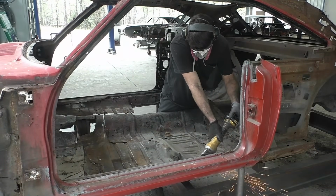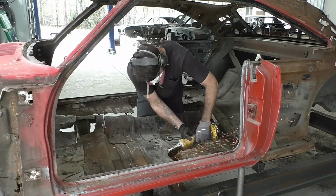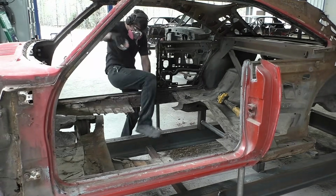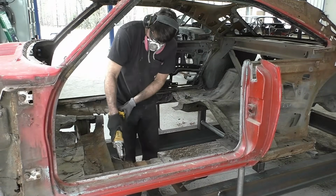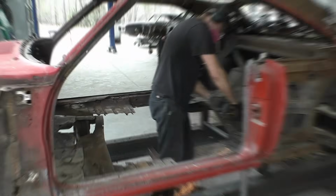And then we'll take the air chisel and finish removing all the rest of the spot welds and digging around them. Again, right now with the cutoff wheel, we're just perimeter cutting everything. You can see this whole process right now, I'm going through a ton of these cutoff wheel discs. We're using a bunch of the batteries. I'm cycling through batteries. We have a bunch of them on standby, especially since this cutoff wheel is running nonstop.